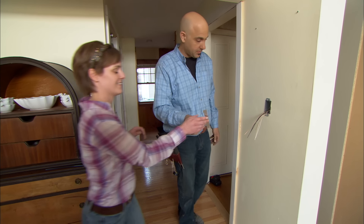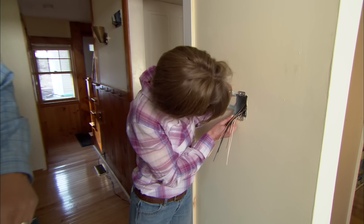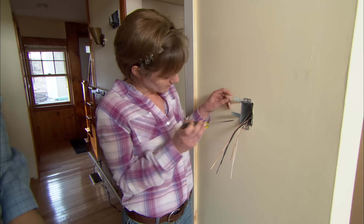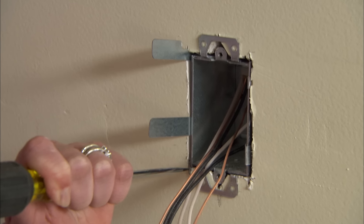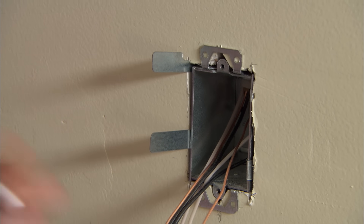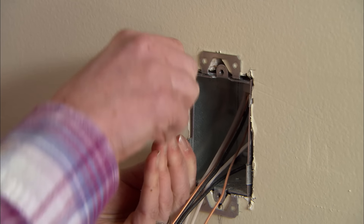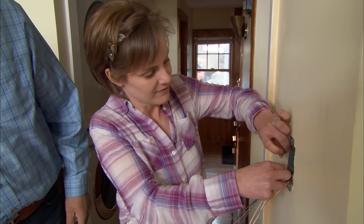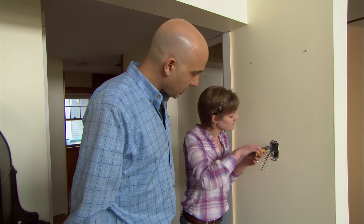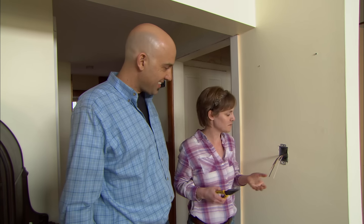You want to try one? All right — so long side first. And now take the pliers and the screwdriver and just tap it in. Now push it all the way through. You made it look easy. Even it in the box and pull back on it. And now we'll go ahead and squeeze it with the pliers. Get the bottom one a squeeze. Now pull the wires — solid, right? Doesn't move. Let's get the switch in.